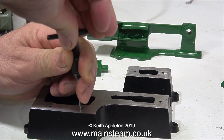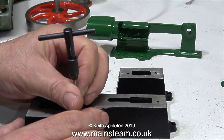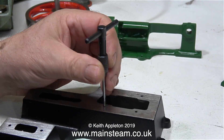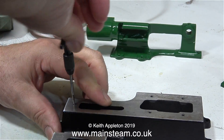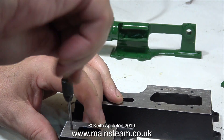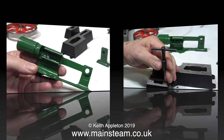The two reasons being they are quite badly marked and they are rusty. Instead I'm going to use some cheese head bolts once again, but this time they'll be brass with washers. First I need to re-tap the holes to make them 6BA. I assume this engine is of German origin so the original ones will have been metric, but now they're all 6BA because that's the standard I use.